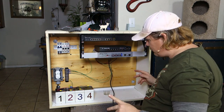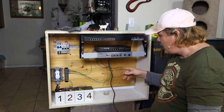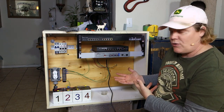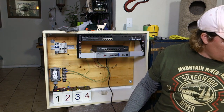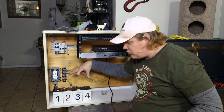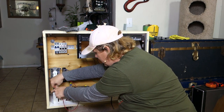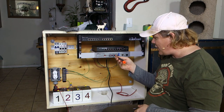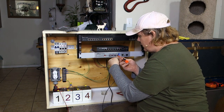We've got the basics so far. Now we need to hook up our power leads. The switch is doing the majority of power distribution so we hook it up appropriately. You're going to see 'zero' and 'negative 48 volts' — that's because it's a negative 48-volt power supply, so your zero is actually positive and your negative 48 is your negative. Remember folks — breakers and fuses everywhere. We've got our inline fuse in the battery bank, so if you accidentally short the output it will not explode; instead you'll get a blown fuse.